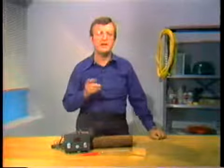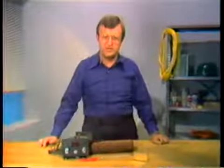Now, soot blowers are the source of other problems in tube-type components. If your boiler uses retractable soot blowers, the soot blower openings should be inspected. Look at the refractory conditions, making sure the openings are free of ash and slag. If the soot blowers are retractable, they should move all of the way out of the boiler.